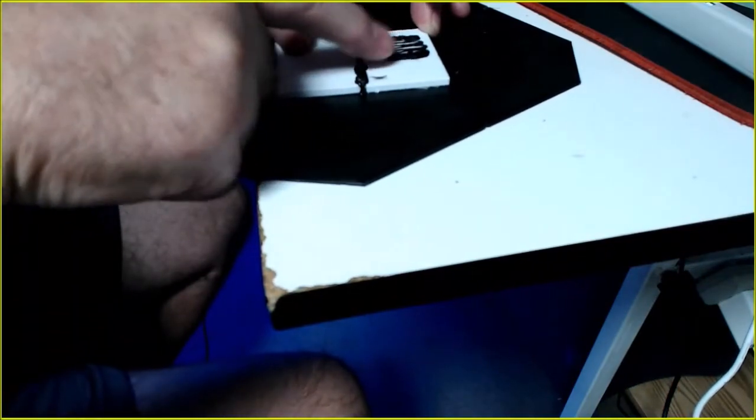There's a little nubbin on the end. While that's cooling I'll double-tap for continuous mode — oh yeah that does work. It's going way too fast; I need to move my hand quicker. I can adjust the thickness by moving slower or faster — real thick at the top, then real thin further along. Here's where I started real thick, then went faster, and this is where I welded the two pieces together.